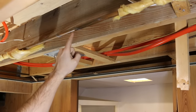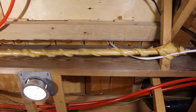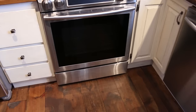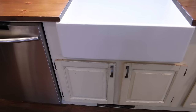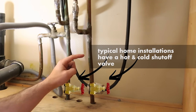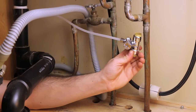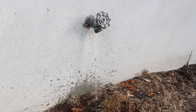The first thing you want to do is determine where you'll be getting your water from. If your basement doesn't have a closed ceiling you might be lucky and have a pipe nearby to tap into, like mine — I have a half-inch water line right below my fridge, so it'll make for an easy install. If you don't have this kind of setup, you might want to run it through your cabinets and connect it to your sink's cold water line, in which case you may not need to shut off the main water valve. Most under-counter setups have shutoff valves for the sink located under the counter. Since I'm tapping into the line in my basement, let's shut off the main water valve and drain the system out at the lowest point in the house, which for me is my exterior hydrant.